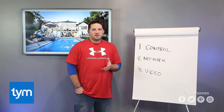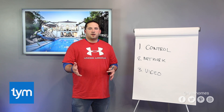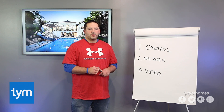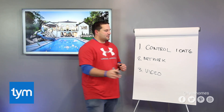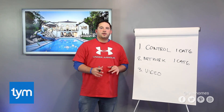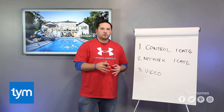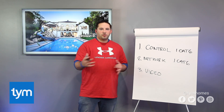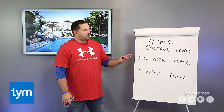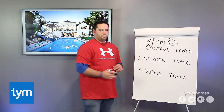If you don't know what you're doing, the easiest thing is to run 4Cat6. Your control — which again is how we're going to turn the TV on and off, change the inputs, change the volume — it requires 1Cat6. Your home network requires 1Cat6. Video is the interesting one. The recommendation for 4K content right now is to run 2Cat6 or fiber. And if you're planning to wire the home yourself, I recommend using 2Cat6. So if you look at this, it's really easy to tell — you may need as many as 4Cat6 per TV.